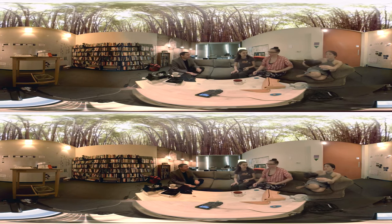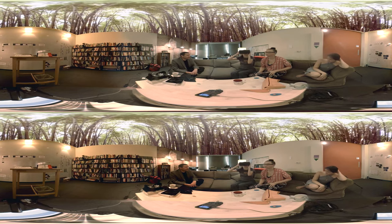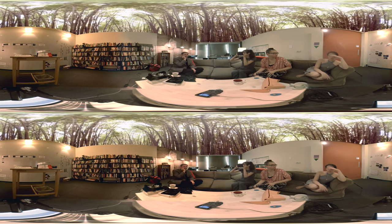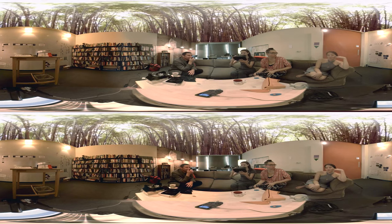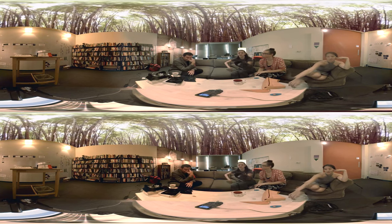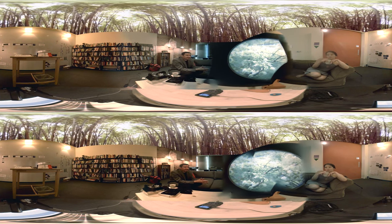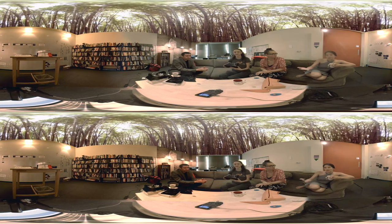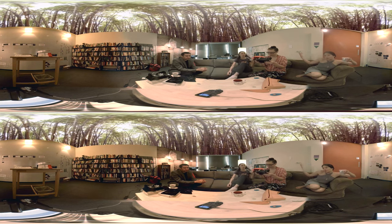So instead of having to do all the work in the software, you can just have lenses that— yeah. For Android, the version we wrote just does the spherical transform and doesn't try to do any kind of anti-barrel projection, because there are so many different things you can stick a device into that I don't know what you're using it in. So that really ends up being the best guess for a random arbitrary device.